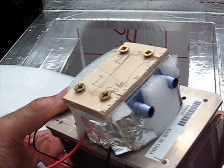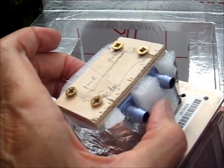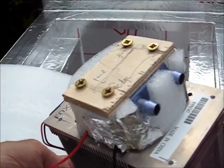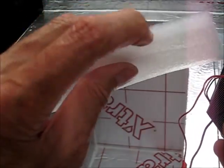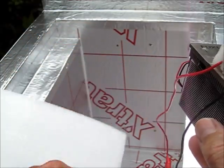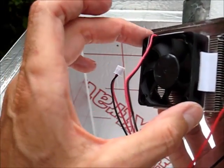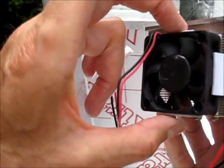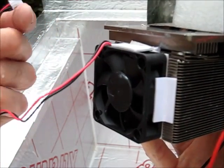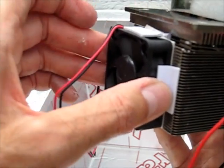In this shot you can see that I've wrapped the Peltier with some waterproof plastic foam — this is just to insulate the junction between hot and cold. This is the sort of stuff you get in packaging. The other thing I've done is mount a cooling fan on the bottom; I've simply glued it on with double-sided sponge pads, though something more secure like cable ties would be better. There's nowhere to screw it on this one, but that'll do for the moment just to see if this works.